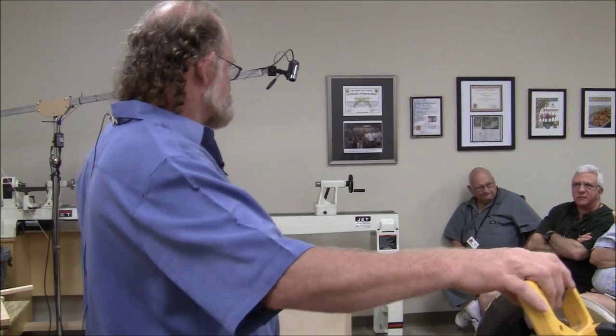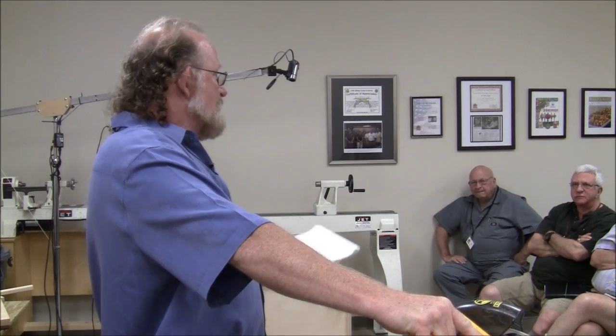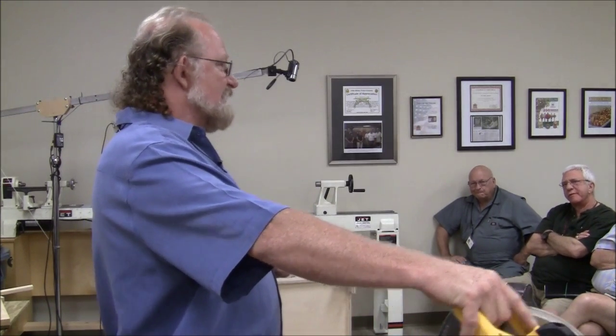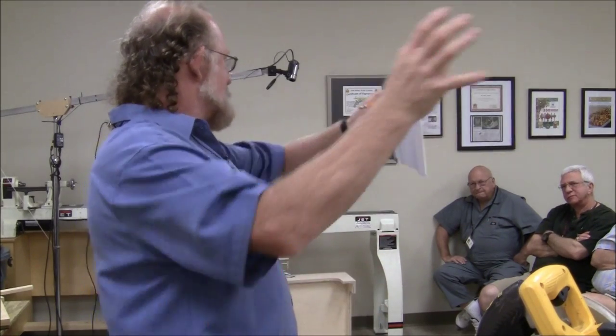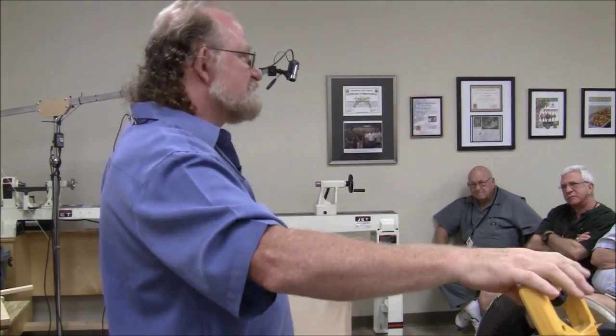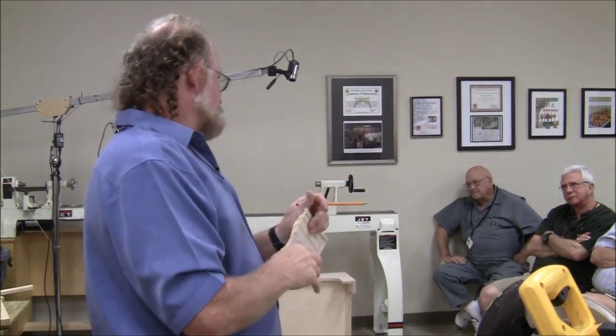Do you normally cope? It all depends. If I trust a corner, on this job I did cope, because I had a lot of things to work around — a pull-down staircase — and I couldn't snap pieces in. The coping gave me a little bit more leeway, I could kind of roll things around a little bit.